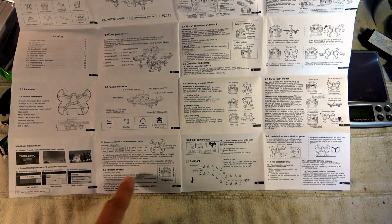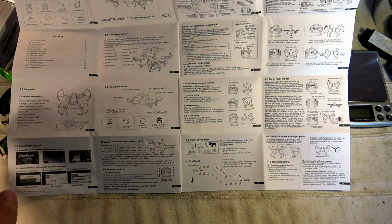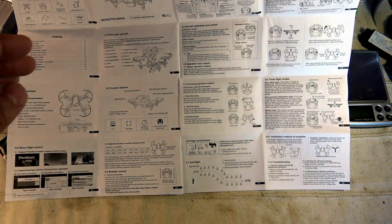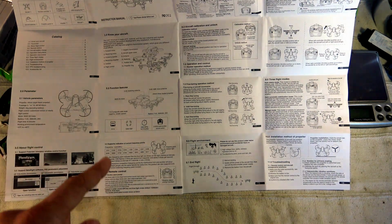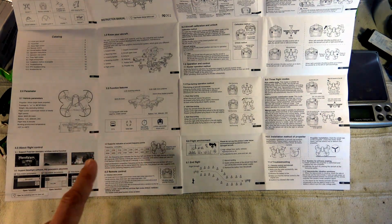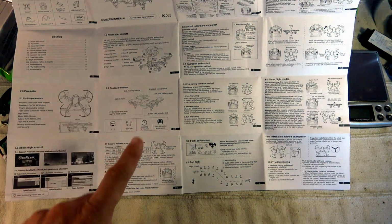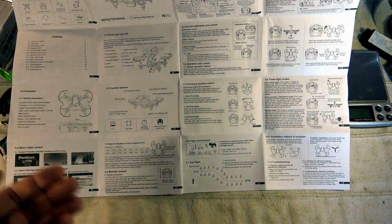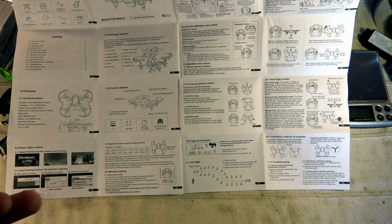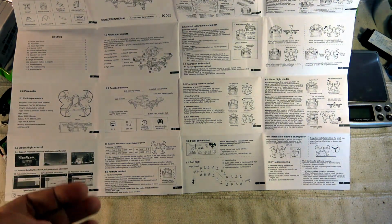We have the list of the frequencies, and I would say first bad news, only one band is supported, the Raceband, so only 8 channels are there. As you can see, there is some vibration when the battery of the transmitter is low. For the quadcopter, I guess yes, and also when you are out of range, when you're losing the connection. So I'm not sure there is finally some telemetry information, because when you're losing the transmission, the transmitter knows it and starts to emit a vibration, but it's completely stupid to emit a vibration when you have lost the link. You need it when you are approaching the maximum range limit you can reach, and I think it's not the case.